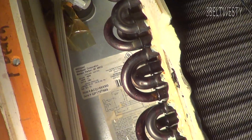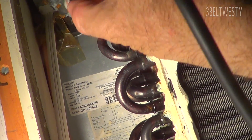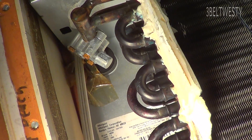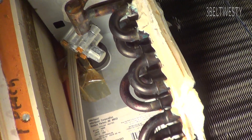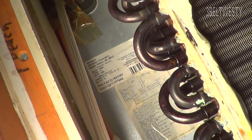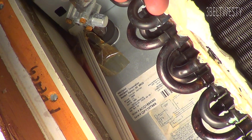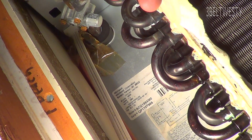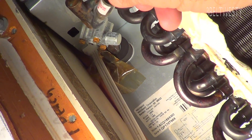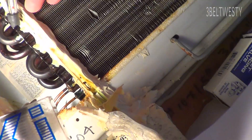What's kind of funny — the reason I'm doing this video is somebody else was saying how these piercing bullet valves always cause a leak. And this one here was put on years ago and I've never found a leak around it. Sometimes you're supposed to braze one on. Here I'm using this piercing valve as a discovery tool in order to find out where there is a leak.